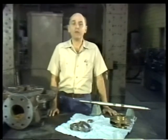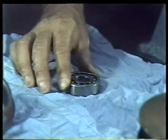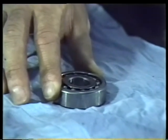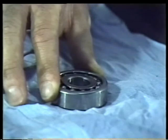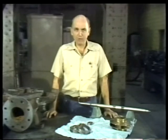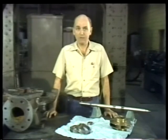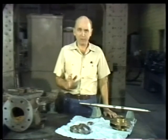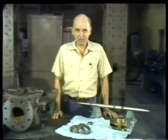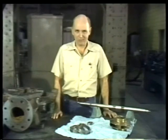Second, be sure that all parts that require lubrication, such as the bearings, are properly lubricated. Forgetting to lubricate a part, or lubricating a part incorrectly, will almost surely cause failure of the part. And third, position each part carefully so that it's exactly where it's supposed to be. Don't forget to pay attention to any witness marks that you made. By following these practices for any piece of equipment that you disassemble, you'll find the reassembly procedure goes much easier.